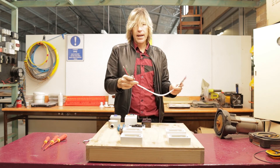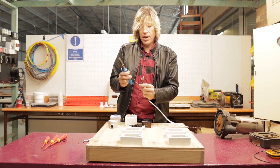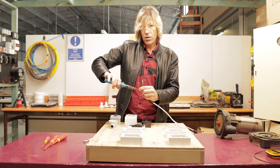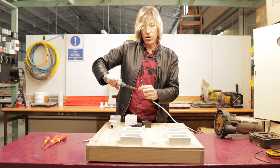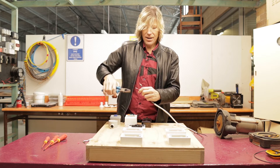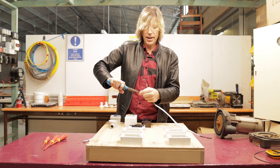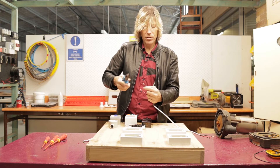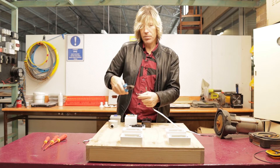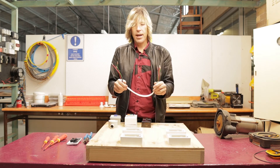My other end has been prepared. Quite important — when you are preparing your cables for termination, if you have a very small terminal block, you may need to massage the ends of the cables, giving them a bit of a squash to make them fit. A lot of light fittings you will find when you are out there working, you will have problems fitting some of the cabling in. Especially if you are working on a rather large circuit and might be using 2.5mm cable — they just don't fit into the terminal strips and you have to make some adjustments. But we can talk about that in another video. Ends are ready for termination.